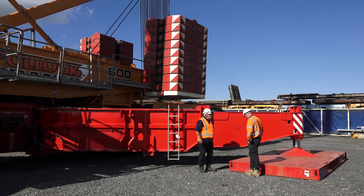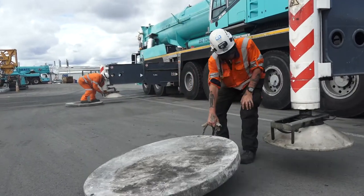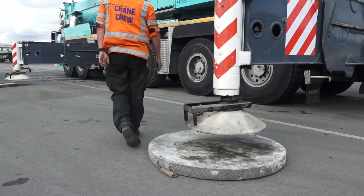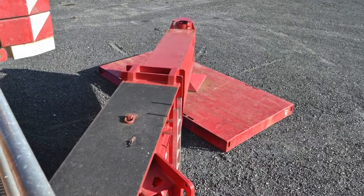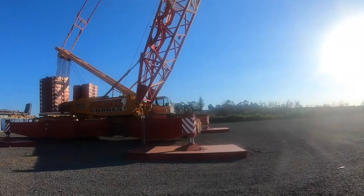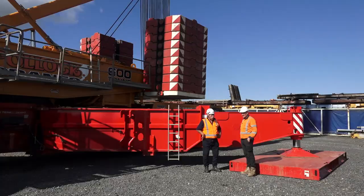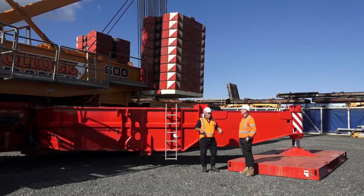This pad - is that what you call it, a pad? Yes, this is an outrigger pad. We looked at one on the 350 where the guy just shoved a round one underneath, but this is more than a round one. These pads are designed to take the maximum force that's going to be applied on these outriggers. It's basically designed to spread the load so we're not putting too much load on the ground. If you didn't use one, it'd poke a hole in the ground. Spreading the weight is what it's all about.